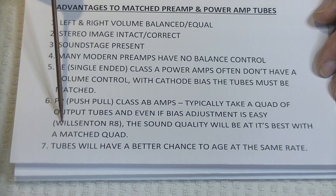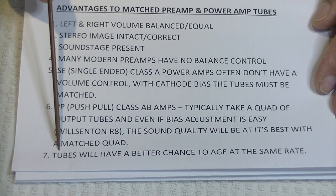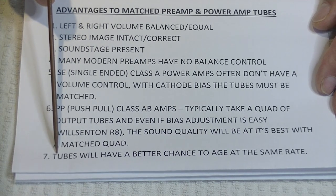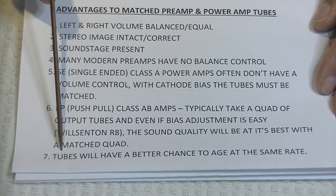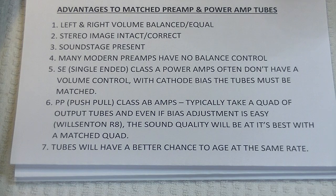And lastly, what about tube longevity? As tubes age, if you had a vintage set of power tubes and one of the tubes is really a mismatch, sure, you can adjust the bias to bring it in line with the other tubes. But how long is that tube going to last? It's probably going to die long before the other three. And now you've got a trio, which is not very good for a push-pull power amp. If you've got a seller for your power tubes who has a lot in stock, and you're buying a vintage tube that's 40 years old, ask them if they can supply you a matched fifth tube.